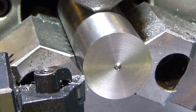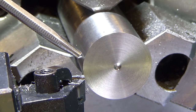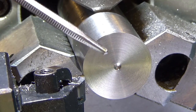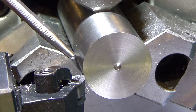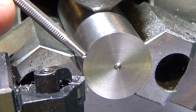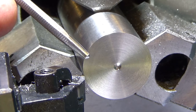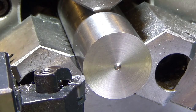My wife wants me to make her a ring out of titanium, so I thought I'd just give it a shot real quick. Anyways, it should be a really quick project and maybe not overly interesting, but I'm going to see if I can color this one electronically, because I have acquired the materials and tools to attempt to electronically color some titanium. The coloration process is an anodization process where you're building up an oxide layer that causes interference patterns, and you choose the depth so it interferes with all colors but the one you're interested in. Anyways, we'll give that a shot coming up.